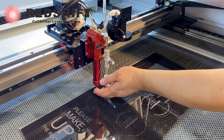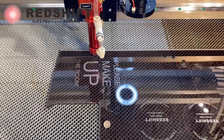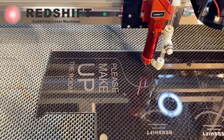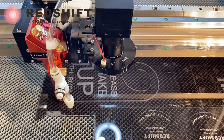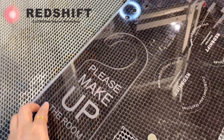Open the air blowing valve. Ready to start laser cutting the outer contour of the acrylic door sign hanger. Once the engraving is done, it's time to cut the sign. The laser is cutting through the acrylic smoothly. Watch as your door sign hanger takes shape.